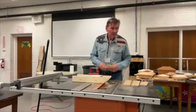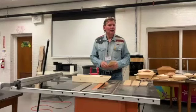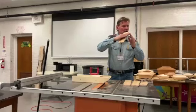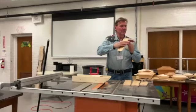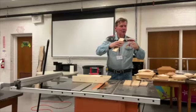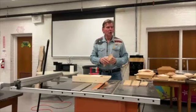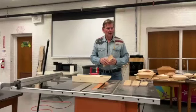And you said you put it at 45. I like to go a little over 45 on all my joints. That way I know that the outside joint's going to hit first. If it's going to fit in properly, the gap's going to be on the inside. So whenever I set a 45, I always go a tiny bit over 45.